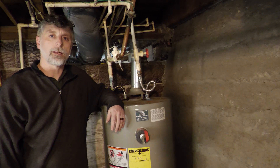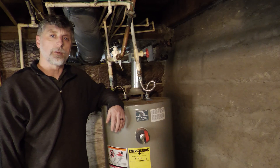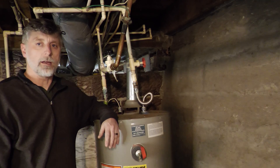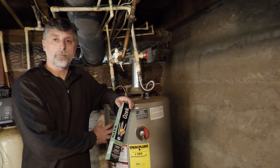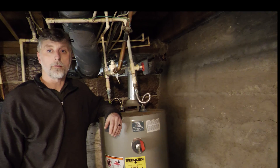You can double the life of your water heater for about $28 and 10 to 15 minutes of your time. Water heaters contain a rod called an anode rod. It sacrifices itself to prevent the water from corroding the metal components inside your water heater, but they wear out.